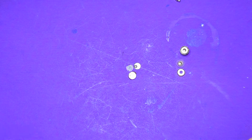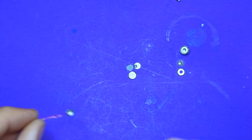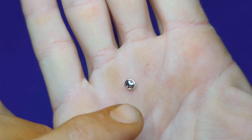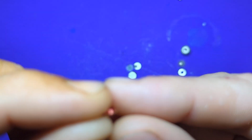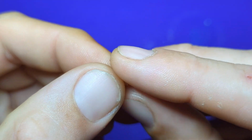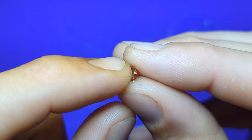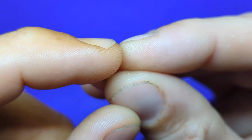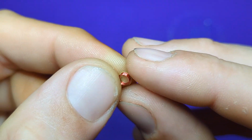So that is the technology that we're seeing with the new FPD drivers, or flat panel drivers. And like I showed you before, this is a 5mm beryllium dome. And just to show you the breakdown of that, this would be like your traditional driver. So there's the dome, you have a little teeny bit of a surround ring, and then you have this huge beefy voice coil. And because the driver is metal, it's very stiff. Now it's still coated. It's got some sort of plastic coating or whatever, but because it's metal coated, it's extremely stiff.